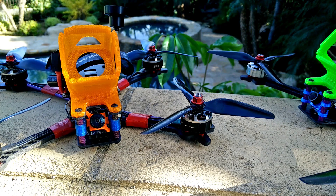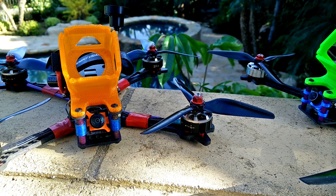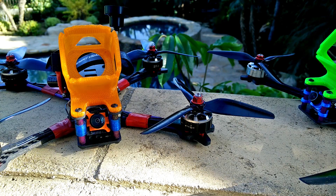I really want to see a 22-08 or 23-08 motor. Race Flight actually has a 23-08 motor, which is probably fantastic — the right KV, right size, and the right spec overall. It should be really good for 6-inch and chunky props because it's got the good KV and the big stator. In summary: wider stators are good for larger props that are harder to spin, and taller stators are good for lower pitch props that spin faster. So I prefer lower pitch blades and higher KV motors to get more gyroscopic effect and feel more in control, with efficient airy frame setups that allow the props to unload better — though that's based on flight feel and performance testing, not formal studies.